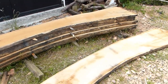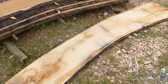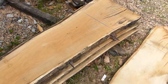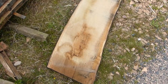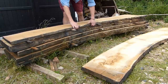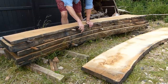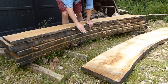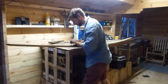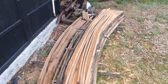And here it is — a lovely lump of oak. As you can see, it's lovely and clear, carrying on through the majority of the length with just a couple of knots. We've got a couple of thin slabs on the top and very bottom, lots of things we can use those for. A slightly larger chunk has two 70mm slabs we're hoping to get some frames out of, and three slightly smaller 50mm slabs that are going to give us lots of ribs. We've already started ripping it down, planing and dressing it ready.